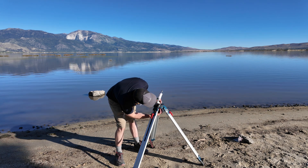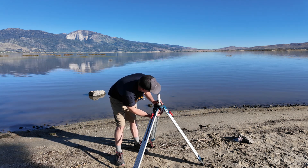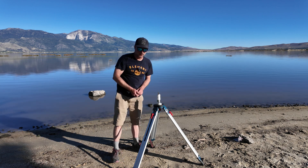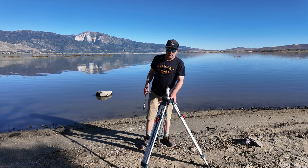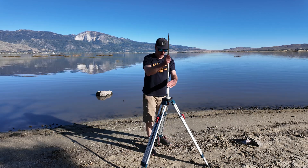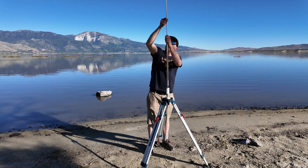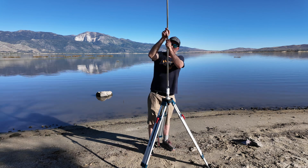You simply put this on, then screw it on there. If you have your shackle on, take your shackle off. Your whip is going to screw in here. On the tripod legs there are these little foot pegs — you can stomp it into the ground to make sure it's real steady. I tried to adjust the legs to get this as plumb straight up and down as possible. Then you simply screw in the whip. I really like how this deploys super fast, and if you have the stingers the footprint is super small. Then just extend your whip.